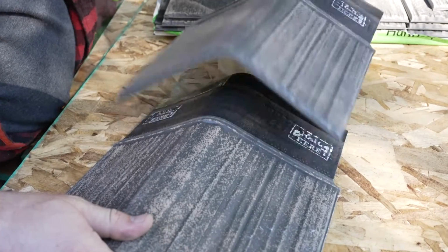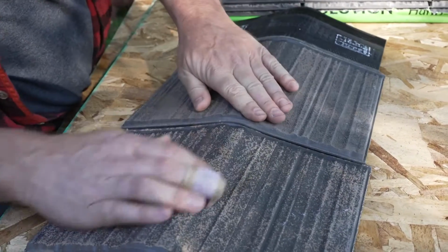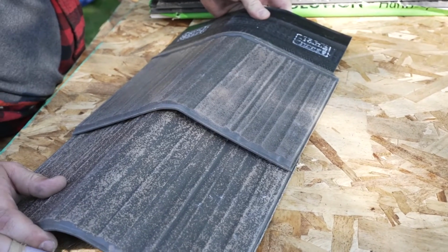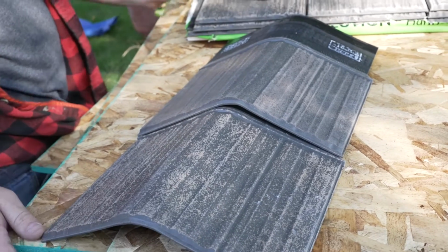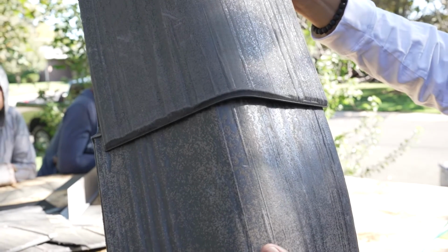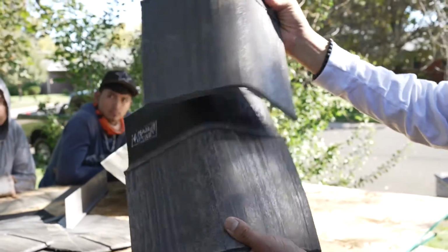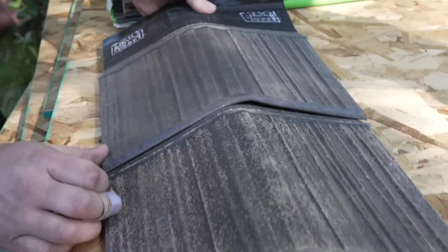Entonces, mira, yo pienso que sí he visto ridges cuando ustedes lo hacen que está un poquito abajo. No puede estar abajo así. Tiene que estar ahí mero. The ridge has to be really, this is important. The ridge has to really be lined up just like that. A lot of people, even our crew has done like that and we had to redo it. So you got to really line it up just like that, or else you might have some problems with wind damage.